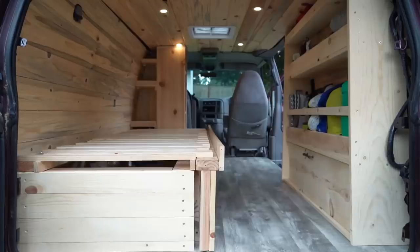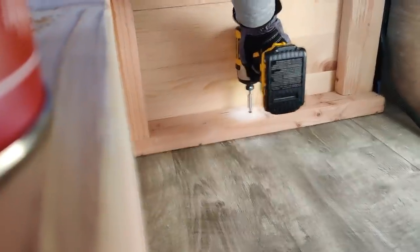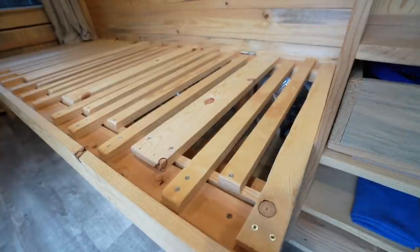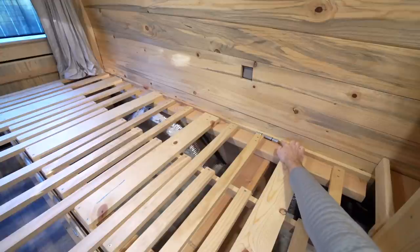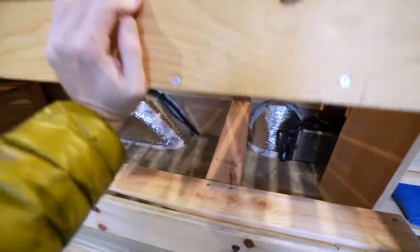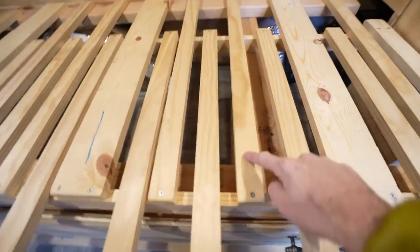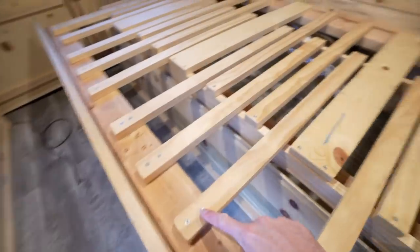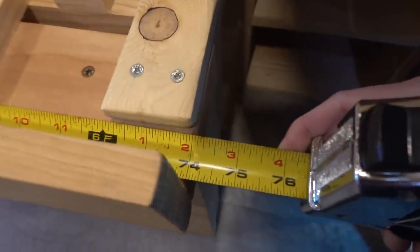The base is made with primarily two-by-fours, three-quarter inch tongue and groove blued pine for the cabinet face, and three-inch pine strips for the back. The frame itself is screwed in place through the plywood floor. The lid is not attached to the frame but rather is attached to the wall by a board acting as a base plate for the two gate hinges. The lid rests atop the frame in both single and partnered mode, and is comprised of a stationary piece and a moving piece.